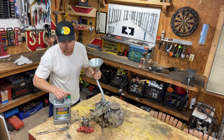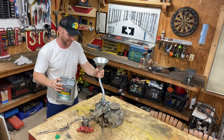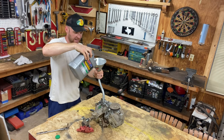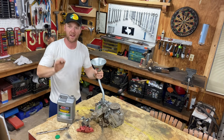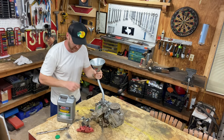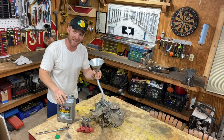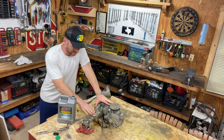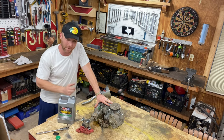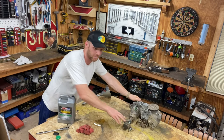You can fill this sucker up after you put it back on the tractor, but for camera purposes we're going to fill her up right now. I've got my special funnel — just take your time doing this. This stuff is very, very thick, so it will take a while. Make sure you fill it all the way up to the very tippy top of the brim, then put your cap back on. For these smaller ones, this one only took maybe 1.5 quarts. For your bigger hydrostatic transmissions with filters on the bottoms, those take upwards of four to five quarts, but for these small guys — I think it's a 2100 series — 1.5 quarts is the way.